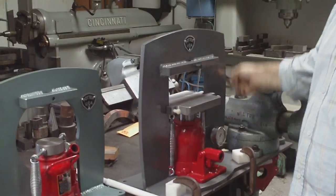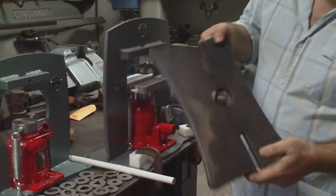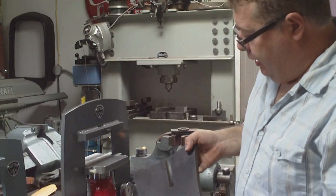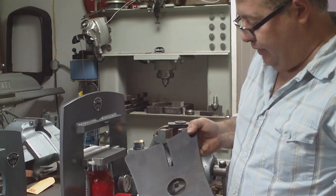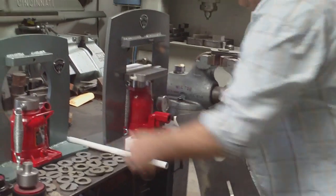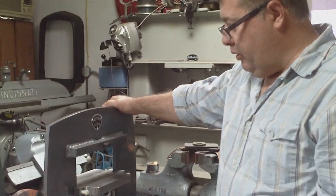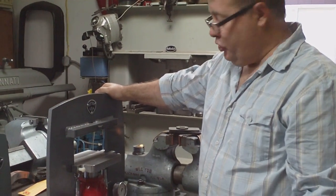These presses are made in two parts. Here's the bottom, and the way it's designed there are only two critical joints on the whole press — it's a lot more efficient and safer. There are only two places where you can have a failure. The metal goes through and it's welded in the back and on the front sides, so it's really strong. It's also lightweight because the shipping on this won't be nearly as bad as other presses on the market — it probably weighs half as much.